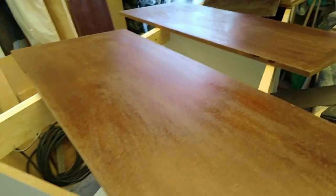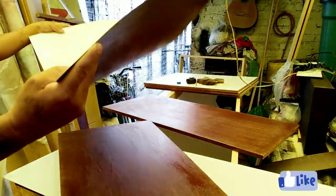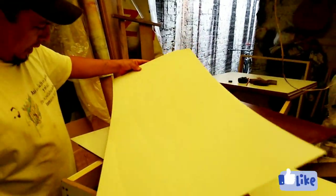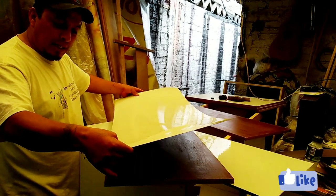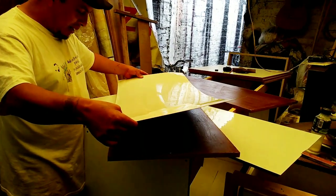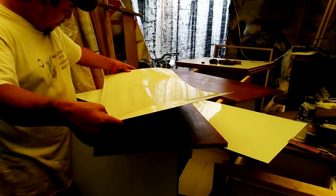Here we have the doors with their glue applied, ready to bond the formica to the surface. We're going to make the contact. As I said at the beginning, let's hope everything goes well because this must be done very carefully so you don't ruin your piece of formica — peeling it off is somewhat complicated. Remember that when you cut your formica, I told you to leave it a little bigger: in this case I left it 3 centimeters larger so we have tolerance for any error.